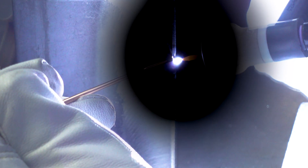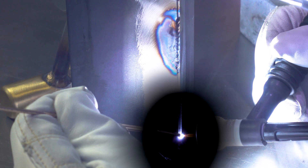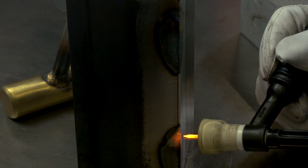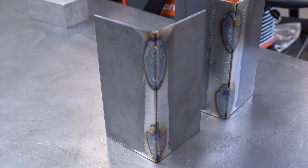For the outer corner joint welding vertically, the S2 seems to weld a little bit nicer — it pulls and kind of hardens up and supports your weld as you're going up. This is an awkward position trying to weld around the camera; I'm kind of side-feeding the rod. The S6 drips a little bit more, but not a hugely noticeable difference — very slightly more runny bead. The final result ends up about the same. If I had to weld up a seam like this, I think the S2 is a little bit easier to deal with.